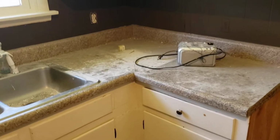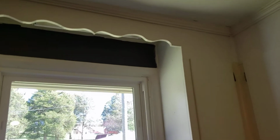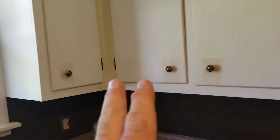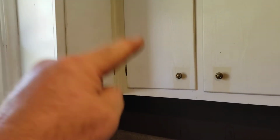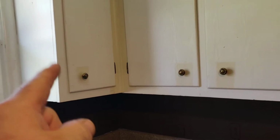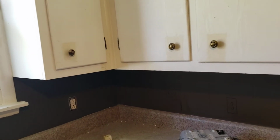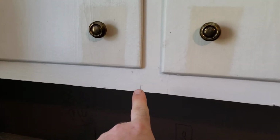Now, on the right-hand side of the window, you can see right here, there's 0 margin. See that? Also here, there's 0 margin. Now, in your design, there's no valance at the top, and he's fine because he wants the shorter cabinets, but he did want to have as much corner space as possible right here. So how we've done this in the past is we take a wall 30-30, a 6-inch 30 filler. We take the left-hand door off of the wall 30-30. We put the 6-inch filler piece in the middle, and we make that a wall blind corner 30. In other words, it pulls to 30 inches, and that is this mark right here, 30 inches from the corner.